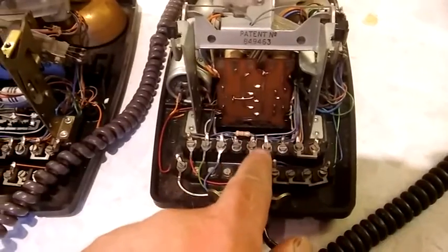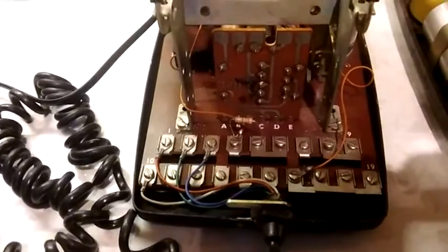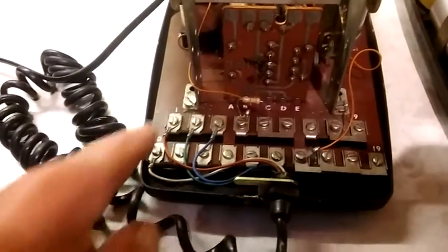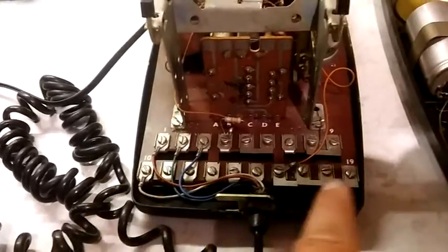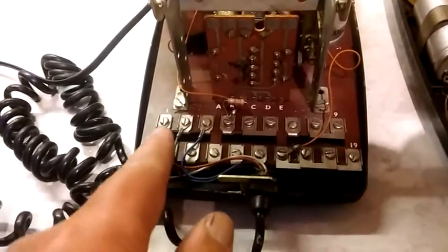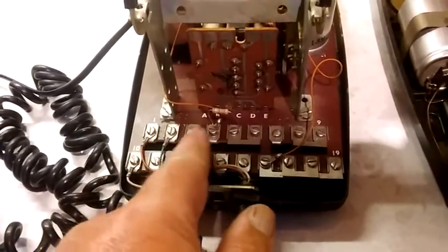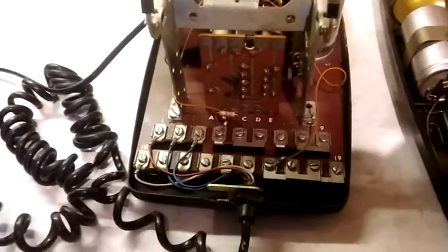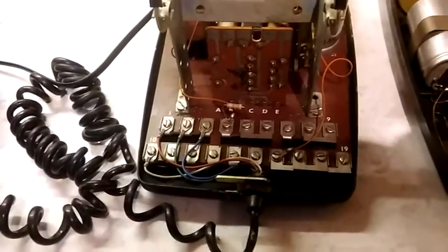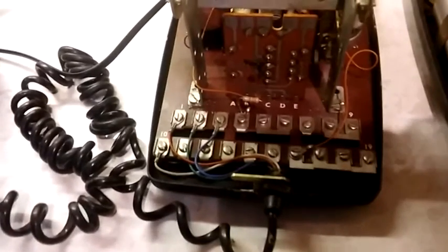When it comes to strapping the terminals together — and by strapping I mean these little things here that you can take out and put between two terminals — the strapping is the same. When we refer to terminals on these phones, we refer to them with numbers: T1 right up to T9, then T10 right up to T19. On this particular model you can see it's helpfully printed onto the circuit board — T1, T2, T3, T4 right up to T9, and T10, T11, T12, T13, right up to T19.